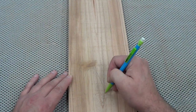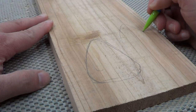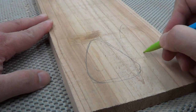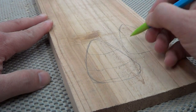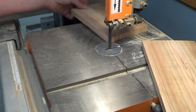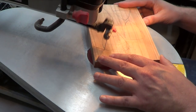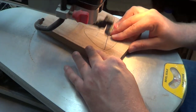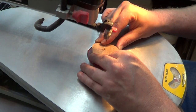With a pencil I sketch out the candy corn shape — it's nothing too fancy. Everybody could draw one of these; it's basically a triangle with rounded corners. I like to make these in different sizes and shapes, and don't worry if they're not perfect because the less perfect they are the better they look. I cut the board down to something a little more manageable, then once they're drawn out you just take it to the scroll saw and cut out the shape. I like to cut out the basic shape first and then come back and do the little curves after.